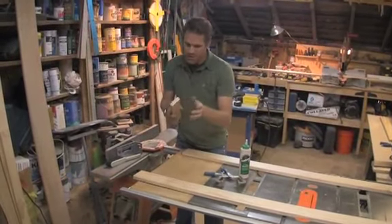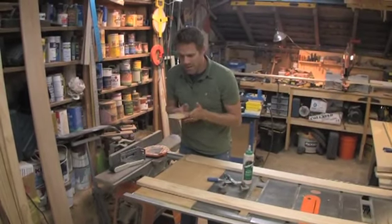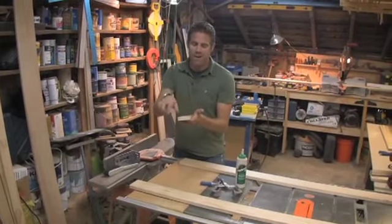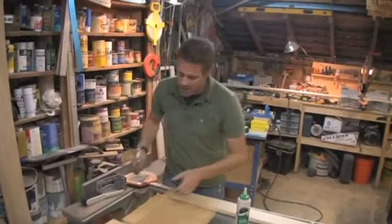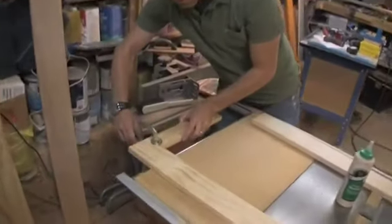So now you've dispersed the glue. You've got a good surface area. So when the screws go in, they tuck it in nice and tight, and they give the bond of not only just the pressure points of where the screws are, but now that glue joint, you have glue throughout the entire joint, which is good. It is probably a little overkill, but I find it to be necessary when I'm doing stuff like this. It makes for a better build.